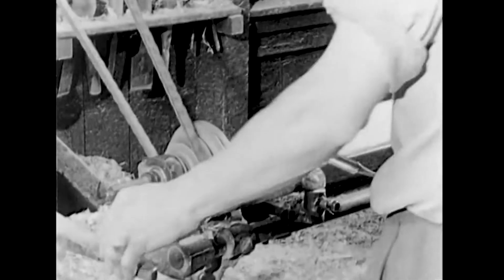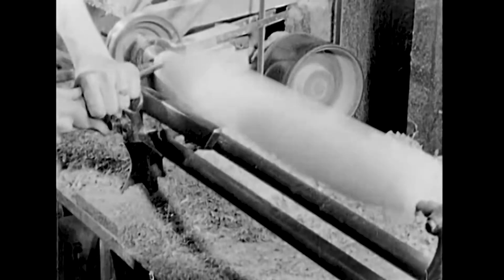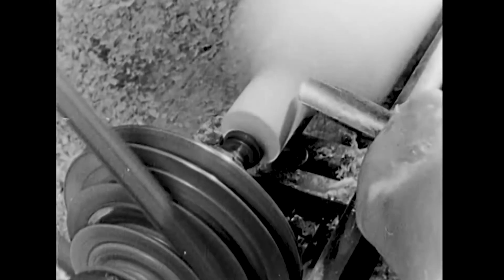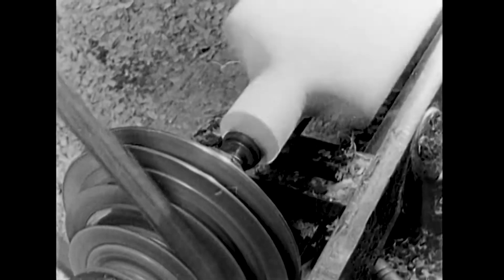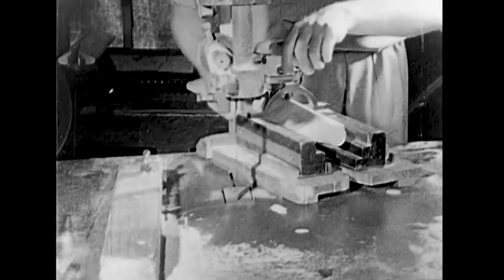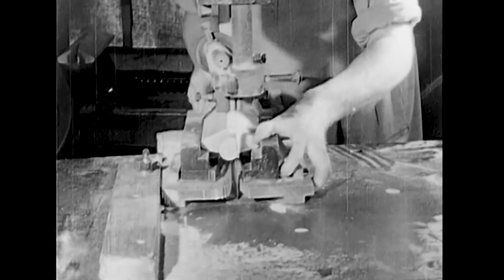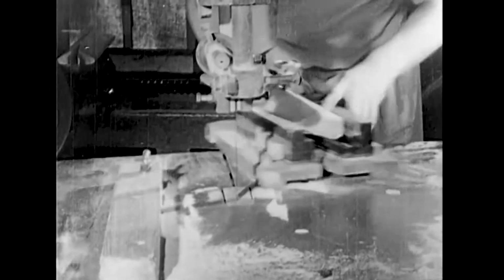The neck of the blade is turned in preparation for the splicing of blade to handle. The splice is cut for the fitting of the handle. As this cut must be carefully made, the bat blade is held in a pattern or jig for accuracy.